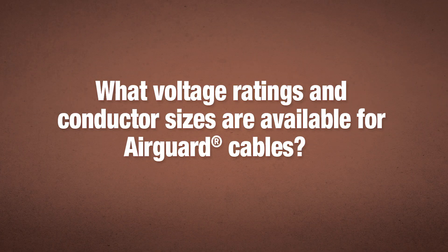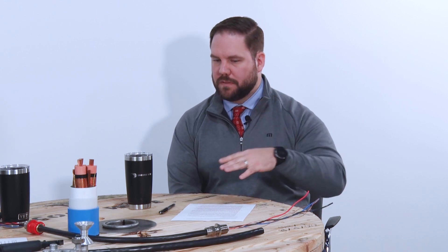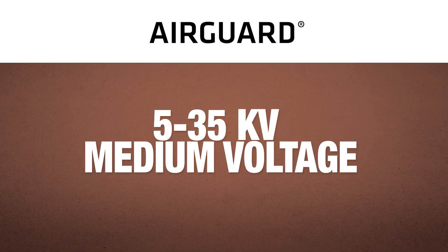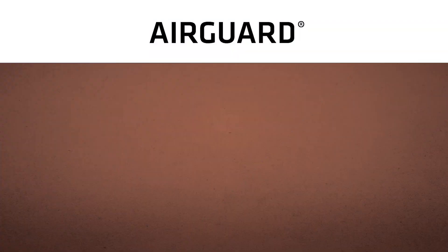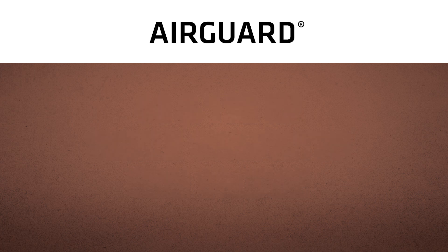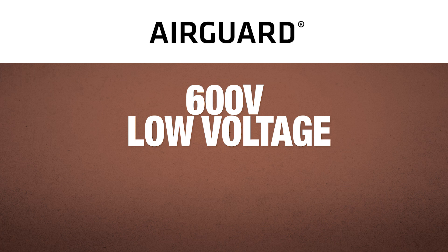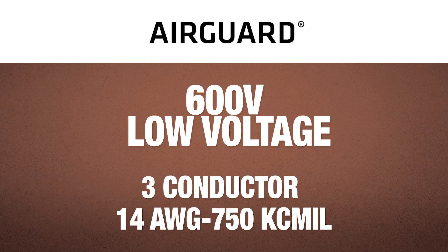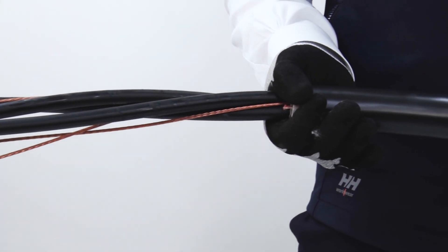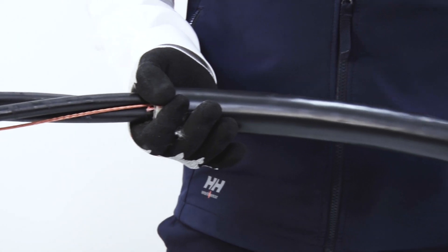From a product standpoint, what sizes do we cover from low voltage to medium voltage? Medium voltage cable — we make 5 through 35 kV. This is actually 25 kV cable, and we do make 69 and 138 kV single conductor high voltage cable, which we've had a lot of success with. As far as the low voltage cable, we make all the common sizes up to 36-pair instrumentation, three conductor 14 through three conductor 750 on the low voltage power side, and all the control sizes. So if you've been using MCHL your whole life and want to give this a shot, we have a cable for you.